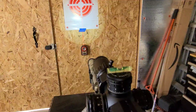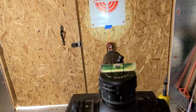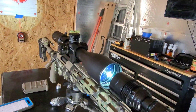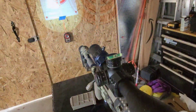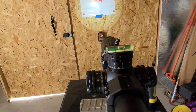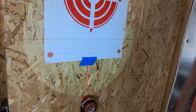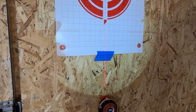As promised, here's the reason why I don't use scope caps or turrets to level the scope. As you can tell, the bubble level is slightly off to the right — however, the reticle projected on the wall is showing exactly true centerline. It's even worse when I take off the scope cap: even though I now have a flatter surface and the bubble level is on the line, the reticle is still trued on the wall. So unless your scope turrets are threaded perfectly on center, the erector system is unlikely to match the flat surfaces of the scope body or turrets.